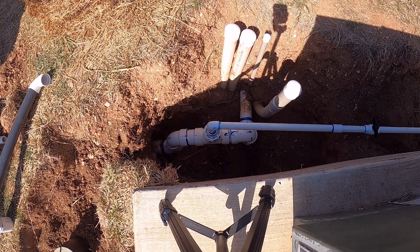So now we've got the main line glued in, and we've also attached the one-inch line that'll go to the new structure off that T on the top there. It's all been glued in and we've waited about an hour for it to cure. Now we're going to head up the hill and go ahead and turn back on the water pressure and see if this holds.